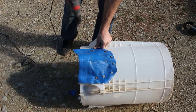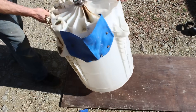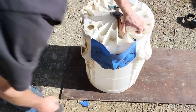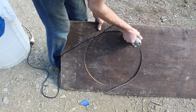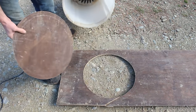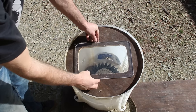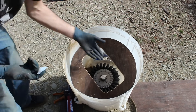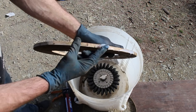I'm making a chute out of an old heavy duty piece of plastic and some screws — this will guide the water back into the stream. Using some half-inch plywood, mark and cut out a cover for the front of the tub. This will add strength and stop water splashing out. A piece of perspex over the front acts as a service hatch and lets you see what's going on inside. Cut the hole big enough to pull the Pelton wheel out for servicing.